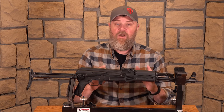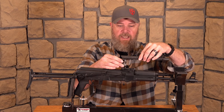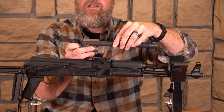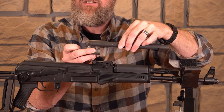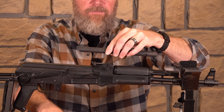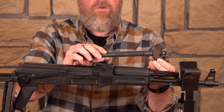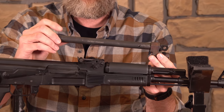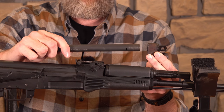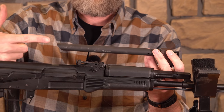The intent we were told was to just leave the handguard on the gun — it's not necessary to take the handguard off or the top rail to clean the gun. We'll talk about that when we get into the gas system. So we have this block back here — this is the gas tube that's going to replace the standard AK gas tube. This is not a final machined product, but it will move into this part here. The gas tube will not be rigidly held; it will be able to be pulled out — not pinned, not permanently held in place.